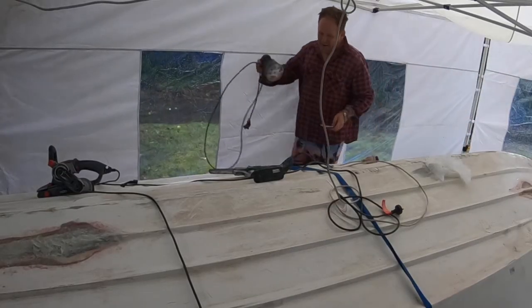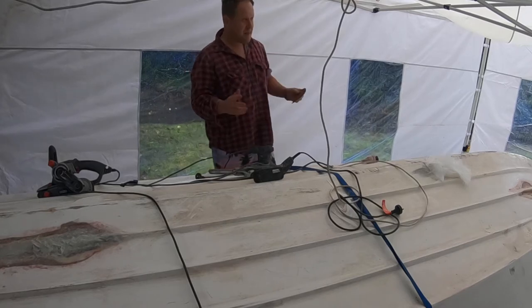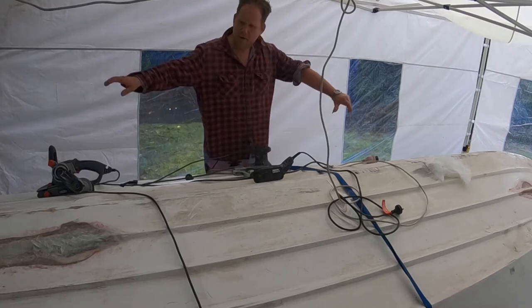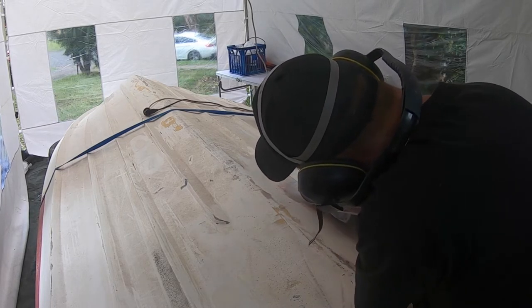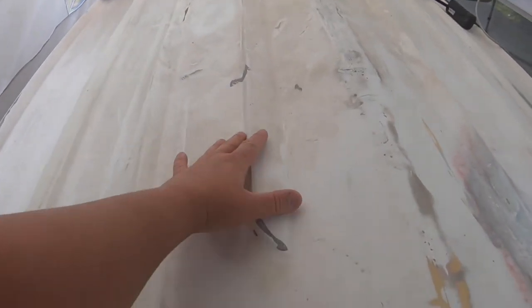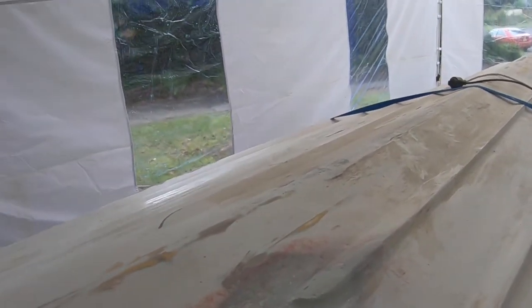Well, no matter — we've already had nine days of rain, a two-day sunny reprieve, and we're back to rain again. But it doesn't matter, because we're outdoors in Sammy's homemade marquee boat studio. We've put a layer of putty on top to rebuild the strake that I had to grind away to get to the crack. So this is the strake that was intact, and this one I shaved back to about here, so I made all this up with putty. How's that? That's my form, eh?